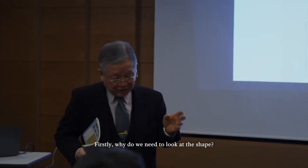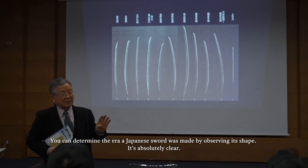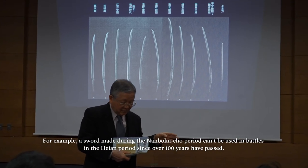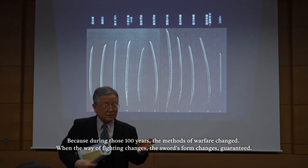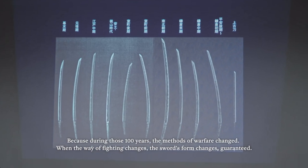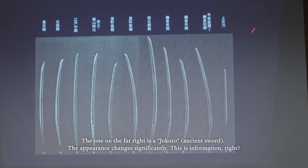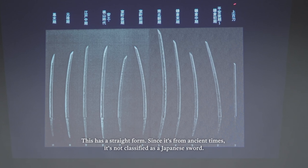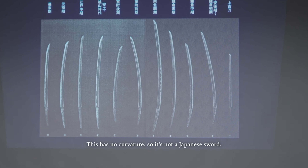You have Hagane, which is hard steel, equivalent to modern 1095 carbon steel or T10, with 0.95% carbon. It is the highest level of carbon and the hardest type of steel, going up to 1.2% carbon on special types of Hagane, especially Tama Hagane. Hard steel keeps sharpness very well but doesn't endure shocks and can break easily if struck against a harder material.